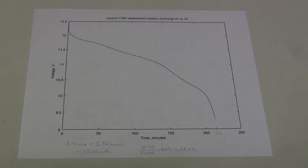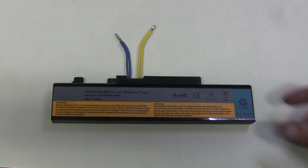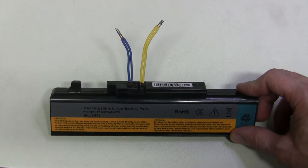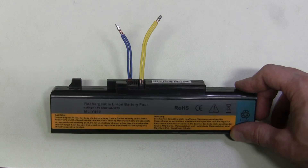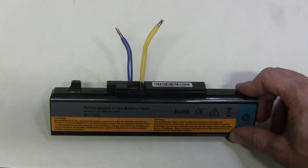And it is quite disappointing. I think I need to charge the battery again and try this experiment again, perhaps a couple times more, because they insist on three full cycles in the instructions. I fully charged the battery pack again and this time I doubled the wires, just to eliminate the possibility that poor connection might affect our measurements.